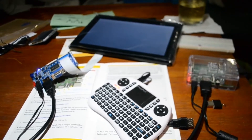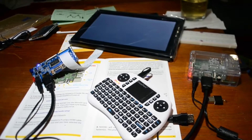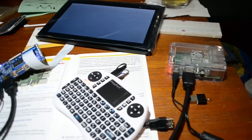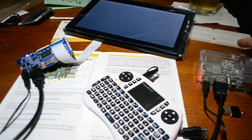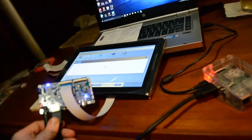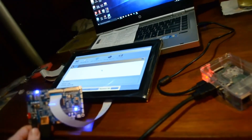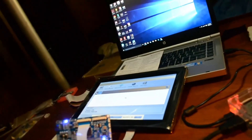Here I've just turned on all of the components for the first time. Nothing's happening other than the backlight of the monitor is on and these LEDs are on. Still trying to figure out what I did wrong. I figured it out — the RGB on the display board here needs to be connected to the RGB ribbon, with contacts down to the RGB on the back of the display. I was connecting to the other port.